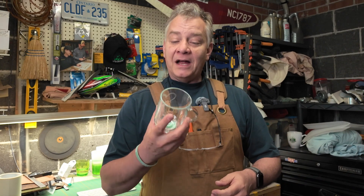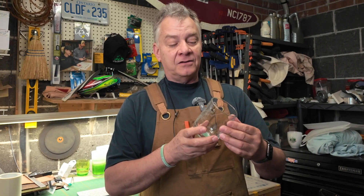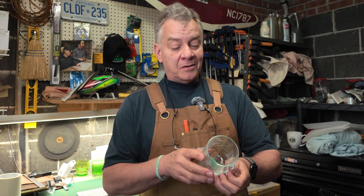About eight, eight and a half months ago, a few months after I got my first laser — which is a Thunder Laser Bolt — I tried for hours testing to get a great effect or a nice engrave on glass. I came to the conclusion that a CO2 laser just does not do a very good job. Too many fractures, too much cracking, no matter what I tried. So many different types of glasses, I couldn't get a good effect.